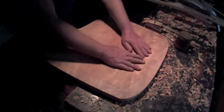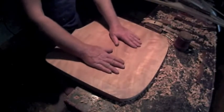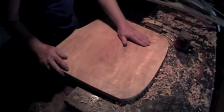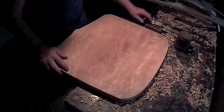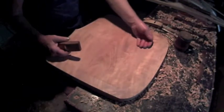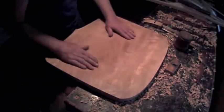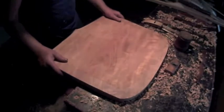The contours from right to left, everything appears to me even. The depth, the curves, everything looks balanced to me. You can feel the edges from the tool marks, as I described earlier. It's a round bottom shaving, and it leaves slight ridges, but the lines of the seat are fair, I believe. It's pleasant. It will be a comfortable seat.